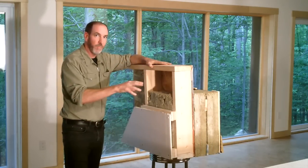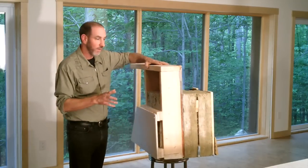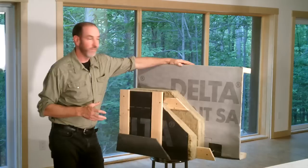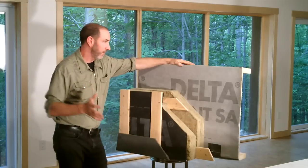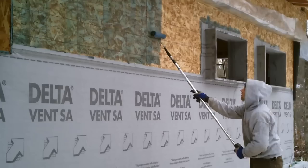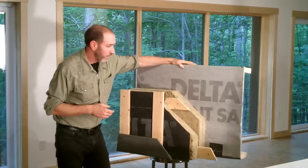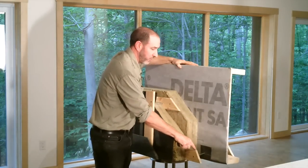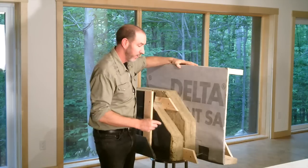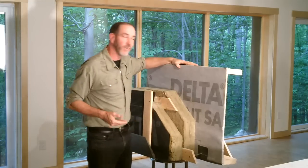The poly was doing two jobs — air barrier and vapor barrier. We've replaced the vapor barrier with the paint, so we still need an air barrier. In this case we're using the Delta Vent SA — it's a moisture-permeable self-adhesive membrane. You put primer on the walls first, then stick it on tight so there's no wind pressure pushing it around. It's going to seal nail holes and so on. Wherever screws were going to penetrate to attach the insulation, we've added small squares of Delta Flex band — a thick rubbery membrane that seals up around the screw holes so we don't get air leakage when attaching the exterior insulation.